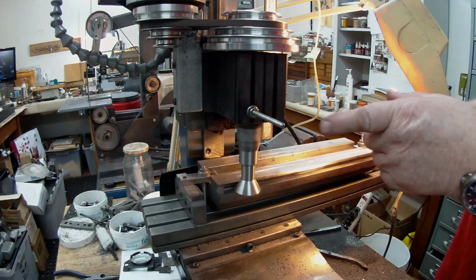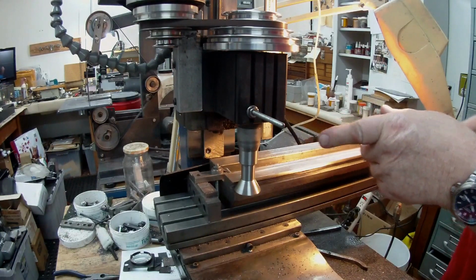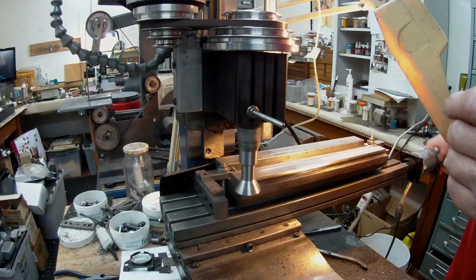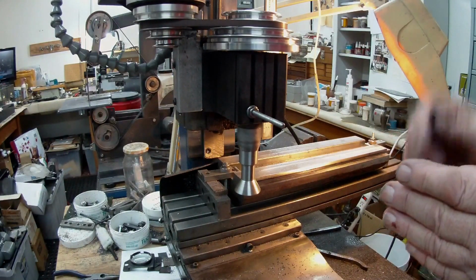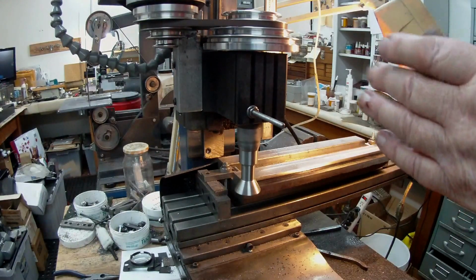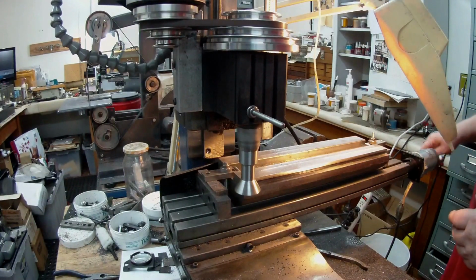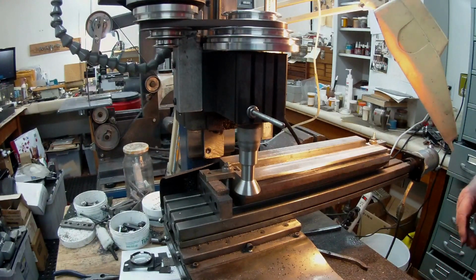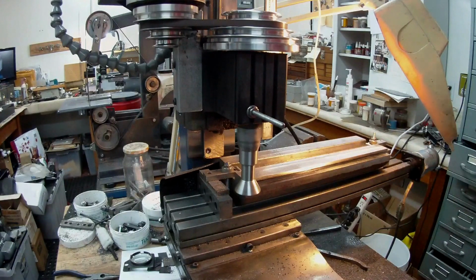Oh, by the way, for the cutter I used the 609 Loctite. What I did was I put 3 grooves about 2 thou deep in the holder, and then I put the 609 on, and slid it up and distributed the Loctite around, and I left it overnight, so it's doing okay. Really this is a situation where I probably will never take this out, or if I do, I'll have to heat it up. It's almost like a fixed adapter.